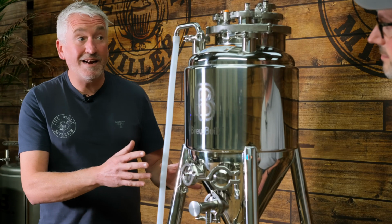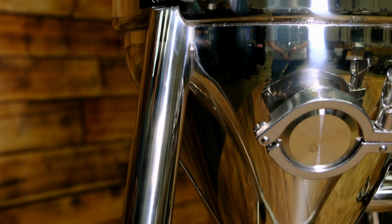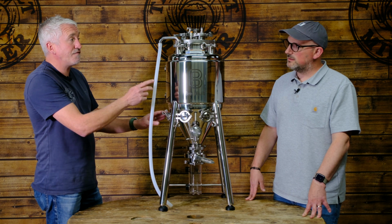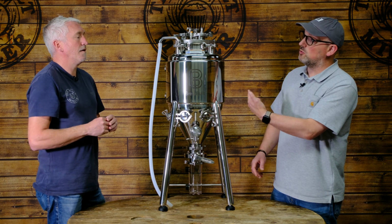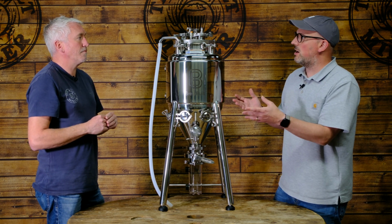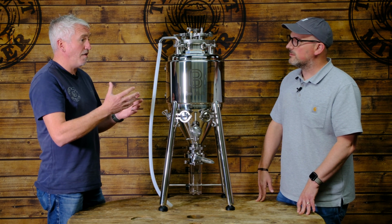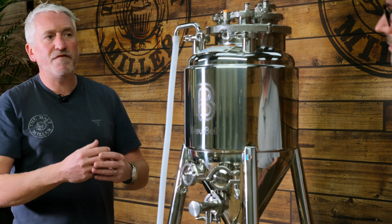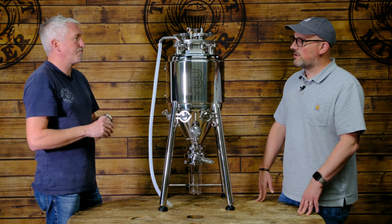Definitely. So importantly, they've actually added another 2-inch tri-clamp. Now this is located on the top of the cone and it's angled upwards into the vessel, and that's for an immersible heating element. So you could have a heating element pointing straight up into your wort to provide the heating part of your heating and cooling solution. Exactly. In some areas of the world it's really important, because temperatures are really low during the winter, we actually need to heat the fermenter. We might be fermenting with some sort of Kveik yeast where you want the higher temperatures. You want to push the range, right?